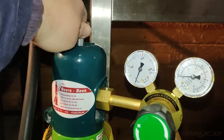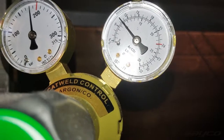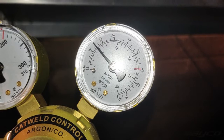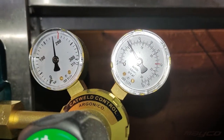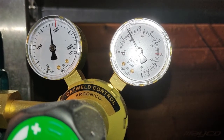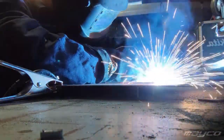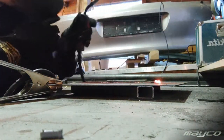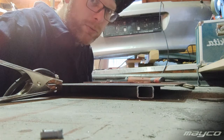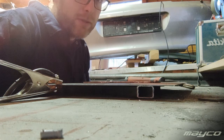The last thing I want to try is to raise the liters per minute slightly, because I was using about eight when I use the torch. I raised it by about two liters. As you could hear, starting was difficult, but once it started it welded okay, so that means the conductivity needs to be changed slightly.